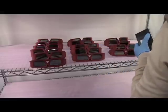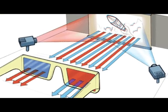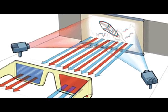The other system was a polarized system with passive glasses using two projectors — one projector for the right image and the other one for the left image. That works pretty well, but you can't with the polarized glasses block the unwanted image as well, so you tend to see a little bit of ghosting. In addition, the two projectors have to be set up and aligned perfectly. If not, the image is distorted in a way that can make you queasy or actually sick. So that's been a problem in the past.